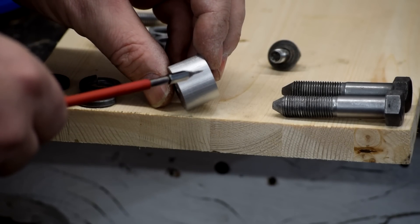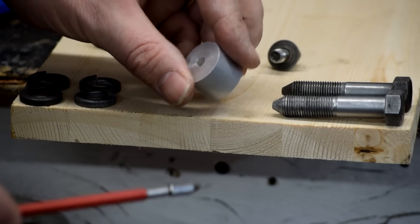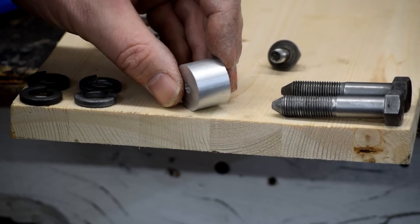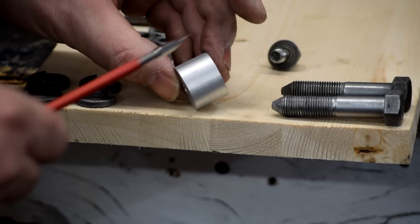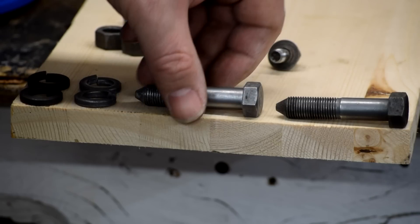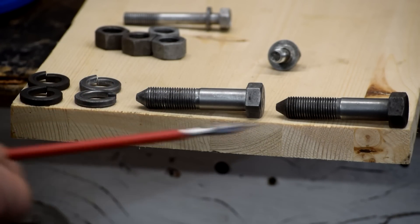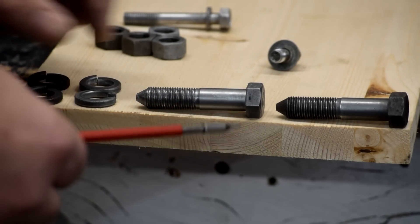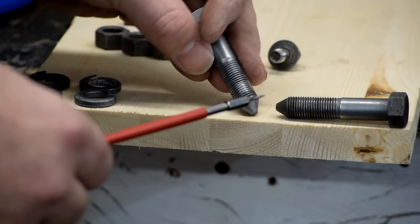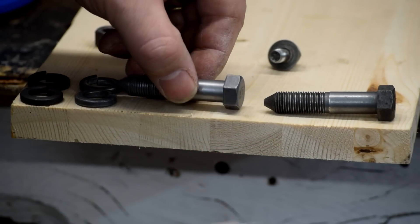The aluminum extrusion — it actually dulled it up a little compared to what the walnut shells did. It didn't touch the machining marks and there was no burr beforehand, so it didn't do much. Probably better off using just walnut shell for about 20 minutes. I've seen walnut shell impregnated with jeweler's rouge, which might be a better answer — I'll try that at some other point. For the triangle media on aluminum extrusion, nothing. These two bolts show the before-and-after: this is after Evaporust, and this is the Evaporusted piece after two hours in the media. After half an hour there was no appreciable difference, but it did brighten things up a little bit. The Evaporust tends to leave a dark grayish sheen, so throwing it in the media brightened it up, which has some worth.